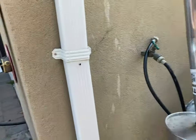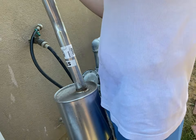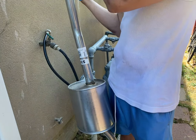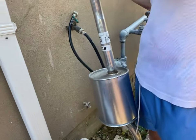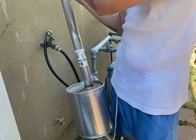This is galvanized or aluminized steel — one or the other. Clean the outside so you can weld. You don't know how much it'll weld through. Especially the old pipe because it has carbon in it — there's no bond if you get a bunch of carbon. It'll probably hold since it's just an exhaust and not structural, but cleaning just makes things go a lot easier.